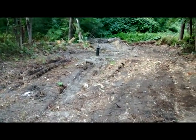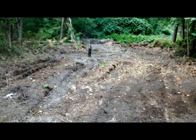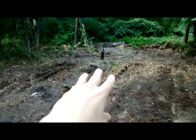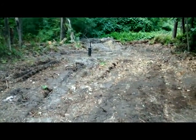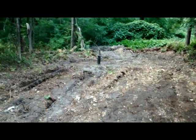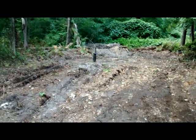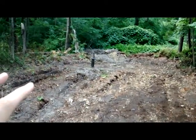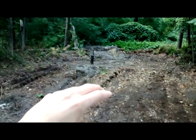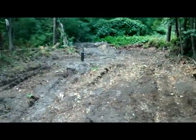The old well was very old — it was probably time. There was also a detection of some kind of not-so-great bacterium in it, which probably could have been handled with bleaching, but we decided to dig a new well. They finally hit water at 700 feet, which was a lot deeper than expected. I'm not sure if it's because it's so dry right now or how water aquifers work in this area. When they hit the water, the flow rate wasn't what they wanted, so we had them come back and do hydrofracking, which opens up channels between individual pockets of water to increase the flow — theoretically now accessing not only the original aquifer at 700 feet but all those horizontally positioned to it.